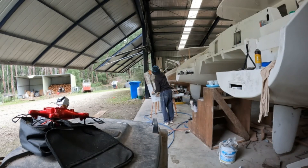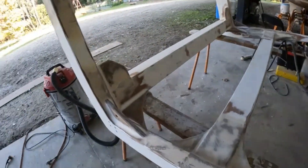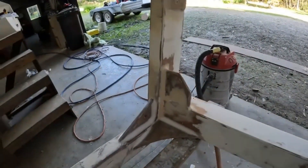We also had an issue with the swivel stand-up blocks we had first used. Although well within their design range, we found a slight bend in one of the brackets, most likely due to the side loading. So we opted to change the design to use 4x50mm standard blocks to distribute the load.